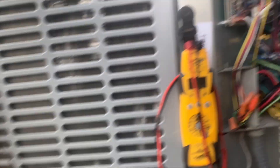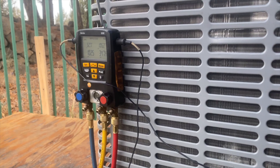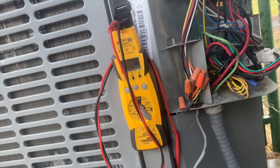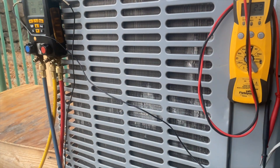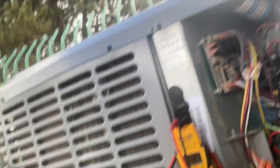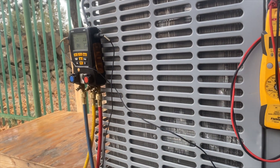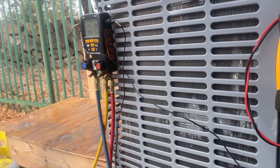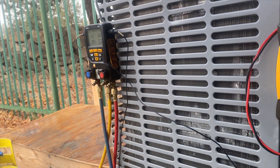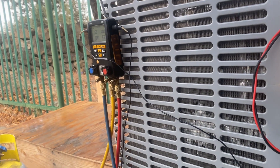We got 15 pounds in — it seems to be heating fine. I'm not familiar with this board but I think these pins are where you set it to go into defrost. I'm basically going to jump out the reversing valve just to make sure it's good. We'll call it a day — it's cold and raining as you can see. This was my first time changing out a reversing valve and it actually wasn't as bad as I thought, though I've seen some that are really bad. Anyway, I hope this helps — thanks for watching, make sure you like and subscribe.